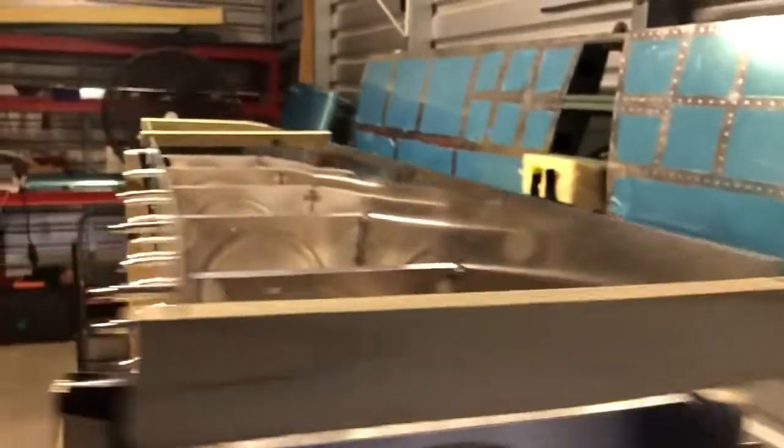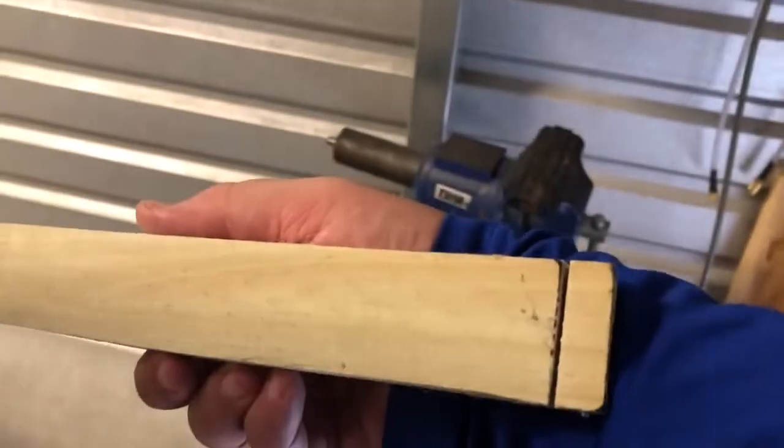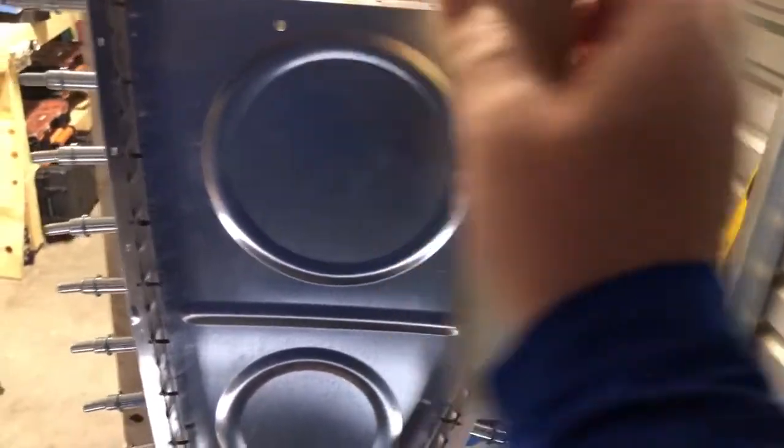All right, so there you go. I've got my blocks in, my support blocks. Very easy to do. 10.5 inches end to end. I lined them up, drew a line, and then cut to the saw's blade depth using my jigsaw. They are ever so slightly canted. As you can see, this bows out. I don't know if you guys can see that. So I got the angle in, and what these do is they just pop in, and right now they're a perfect fit.